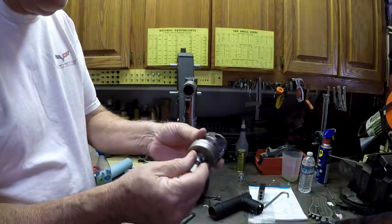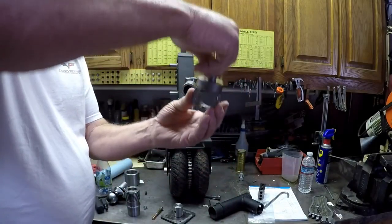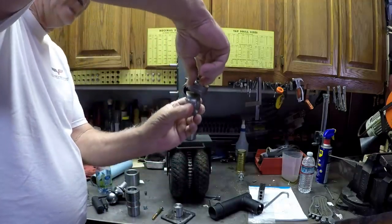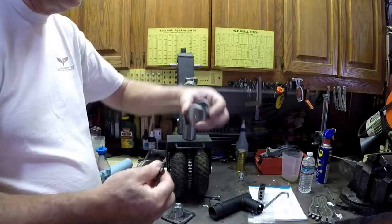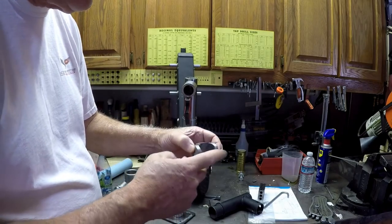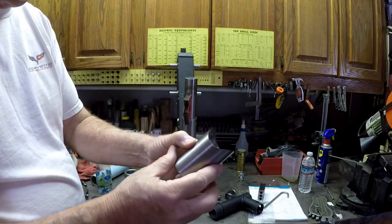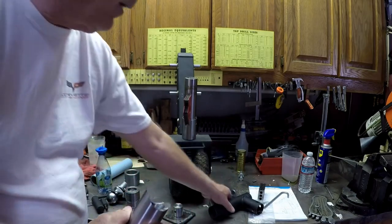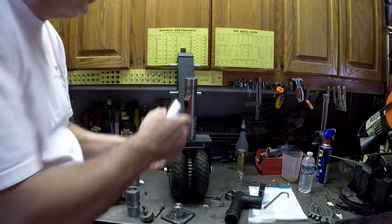It drills a pilot hole and it holds the cutter right in place. So basically it was just like that. Whoop, come on. Got the drill bit stuck. Basically just came down just like that in the end of the pipe and cut all the way to the end. Flipped it 180 degrees, did the same thing, and then just came in with the bandsaw to cut this part off, which ends up with the part like that. Need to bevel all this prior to welding it, but really worked out good. I did it on the small piece first, and then redid it on the thicker part, and it worked fantastic.